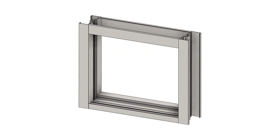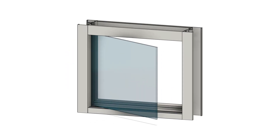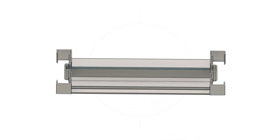So why is this important to know? It's actually quite simple. If you think about how the glass is installed, you grab the piece and you slide it into the deep pocket, then you rotate it into place. This is key because a small pocket just doesn't work, and if it does, your glass is the wrong size. Then you pull back into the other side, centering the glass and locking it on both sides.